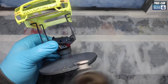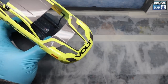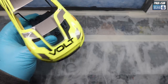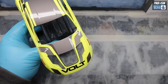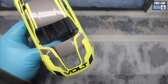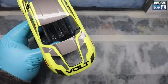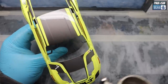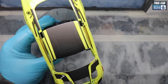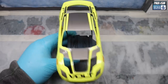And if you're somebody who likes to leave the finish out of the brush, it's going to look too thick. I purposely put this on a little bit thicker than it should, because I'm going to flat it at the end and polish it up, so it will look a lot better. But for now, all we're trying to get is a uniform, even finish all around, with a nice glossy finish. So if you're spraying it now and you look at it and think, oh, there's still a little bit of an imperfection there, or a little bit of orange peel, give it another light go over, because it needs a little bit more of the product on there to get it to self level.